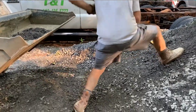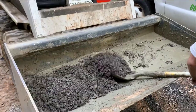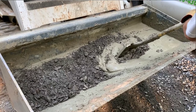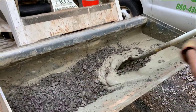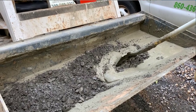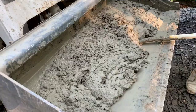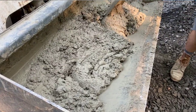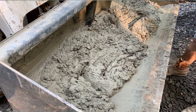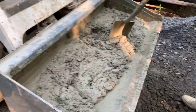You can see here I'm mixing the aggregate in and it's much easier to do your mixing when your mixture is a little bit on the wetter side. Make sure that you thoroughly mix everything together, keep mixing until you come up with a consistency that you like. This here appears to be a very good consistency — not too wet and not too dry.